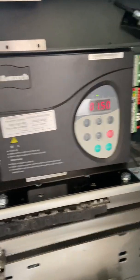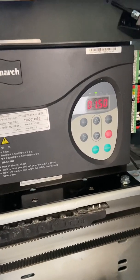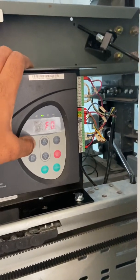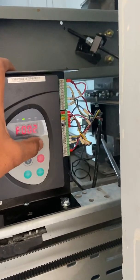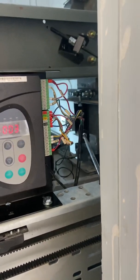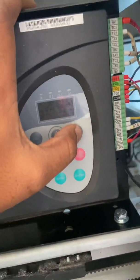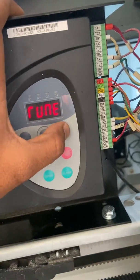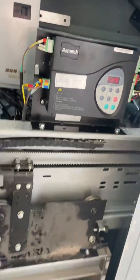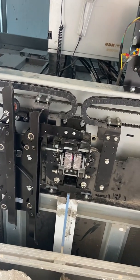I am going to tell you how to tune a motor — tune our door with the Monarch door drive. Let me start with program: enter program 0F02, enter, 0 and F1 16. Enter four, then press the open button and leave it. The door will open and close three times.